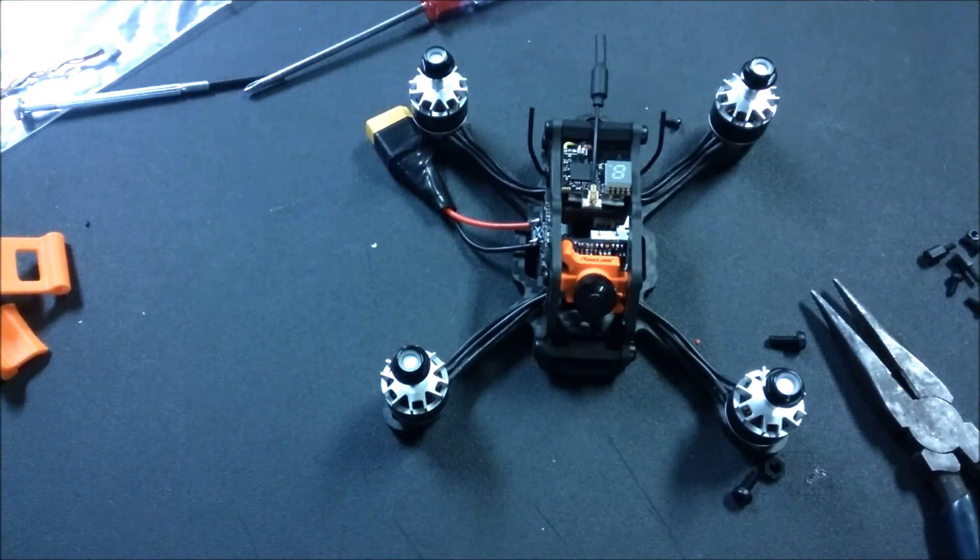Other than that, this thing is an absolutely amazing, super tough looking little quad - I cannot wait to fly it. I'm going to plug it into BLHeli Suite and make sure my motors are spinning in the right direction, then calibrate my ESCs. Also keep in mind that this board has no issues whatsoever changing your settings to Dshot 600, so I highly recommend you do that.